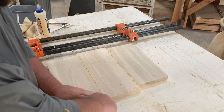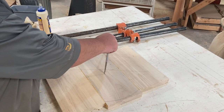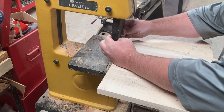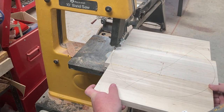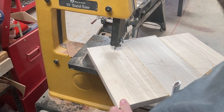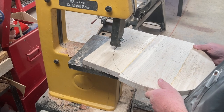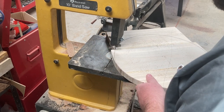It helps if you don't let the glue dry all the way — wait 20 minutes and then scrape it off with a putty knife without having it tear out. Now I just want to draw in the rest of my circle. I have a complete wood blank and I just want to know what it's going to look like. We'll bring our wood blank over to the band saw and rough out a circle. I don't necessarily have to have it perfect. All you really want to do is make sure that you keep that blade outside your line and we can fix everything else on the wood lathe. We just want to remove enough material to save time and so we're not going to have any big pieces flying at us.